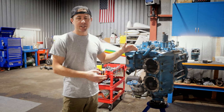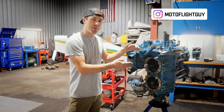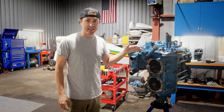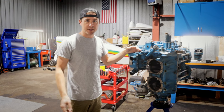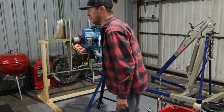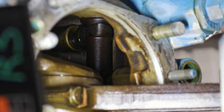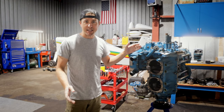As you can see, I've already got two cylinders off the engine the other day. The main reason was I wanted to get my eyes on the camshaft, and as I suspected, the camshaft is unserviceable in this engine. I did take some footage of it, so I'll roll some clips right now, but it's hard to photograph the camshaft while it's inside this engine. So we're going to go ahead and split these cases and I'll show you guys what this corroded camshaft actually looks like.